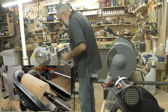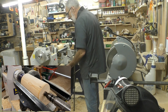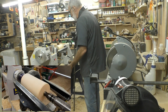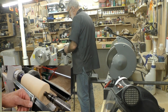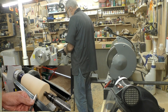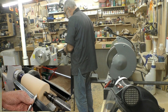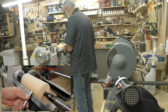That's why it's important — look, without even moving I've got a fairly nice shaving there. So with this spindle gouge, the first thing to do is rest the tool on the tool rest, rub the bevel, get a nice steady balance position, rub the bevel, lift the handle until you get your cut, and move across the work. You can see where the cut is coming from — just to the left of the nose on the left wing.